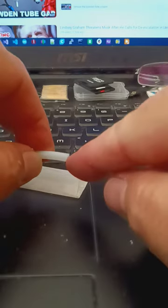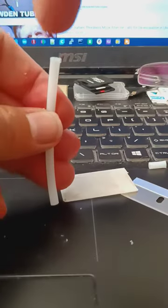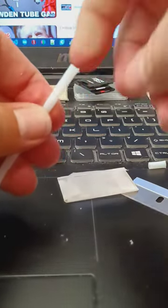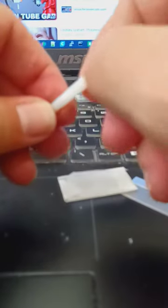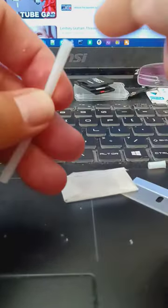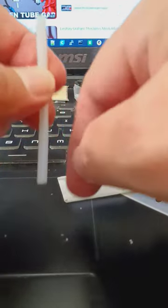So that's the type of cut you want on the other end. You want the flared end anywhere where the filament is coming into it — that's going to guide the tube from a larger opening into the smaller one, like a funnel all the way down into the hot end.